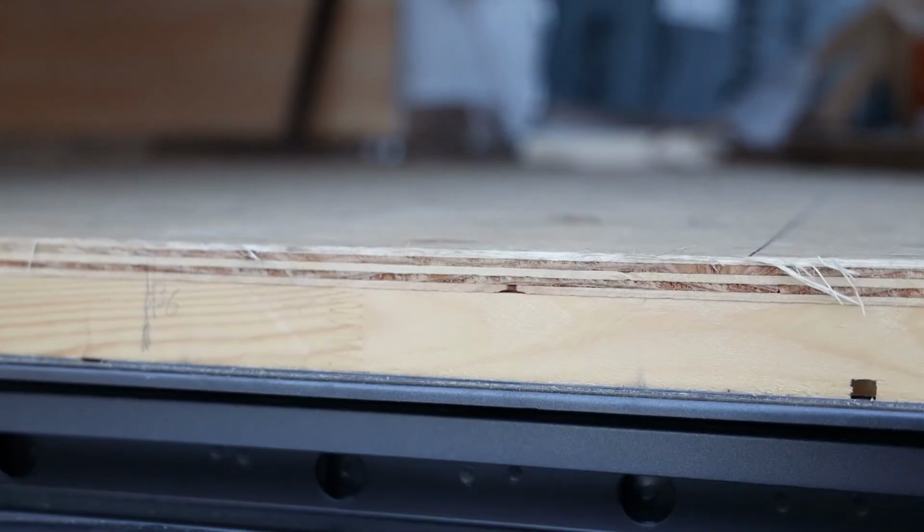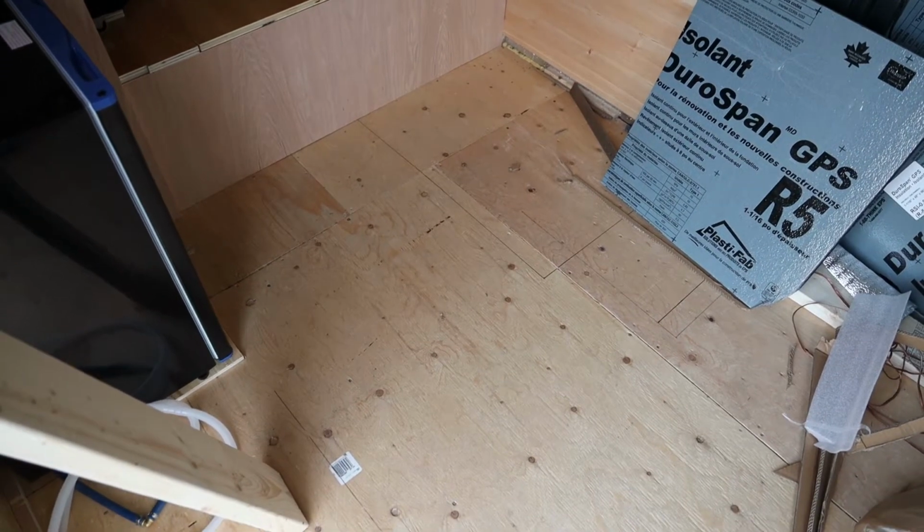For the floor, we screwed in some 2x2s and 2x4s into the base, and we continued to cut the appropriate rectangular sizes to fill the gaps, and topped it off with a 1/2 inch of plywood. To really get all the edges, we decided to use foam spray insulation.